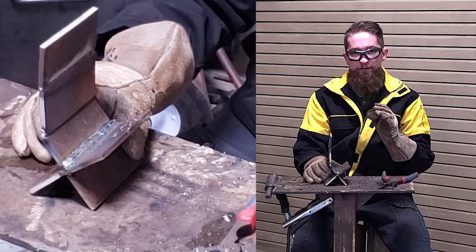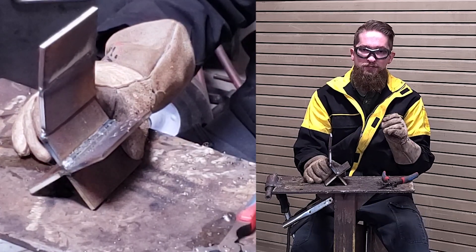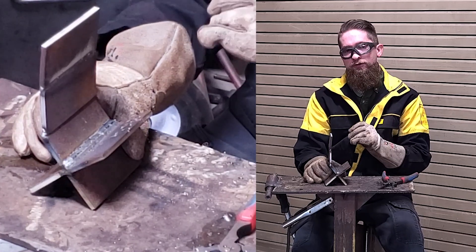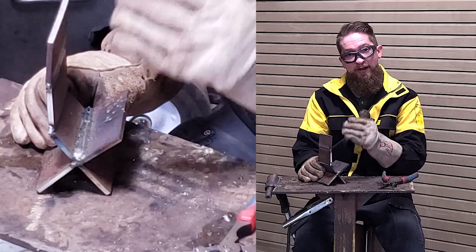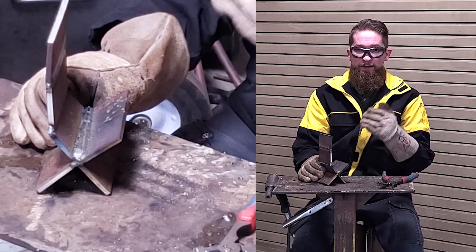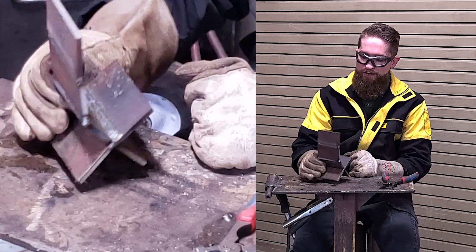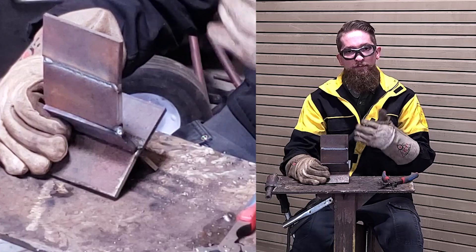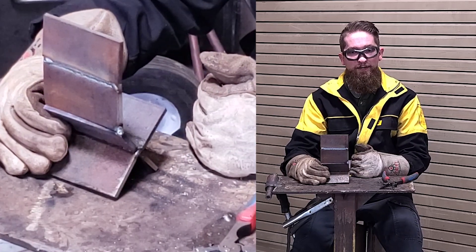Don't just turn your voltage up because all that's going to do is flatten out your weld. Between each attempt, try increasing five or ten inches per minute on wire feed speed if you're not getting full penetration on the previous weld — that will help you drive that puddle in there. Lead that puddle, be at the front end of it. Do your best. I really like this weld — I think it's one of the most fun ones for me personally, just because of how it turns out when everything's set up just right. Good luck.